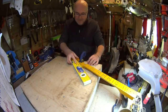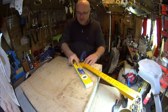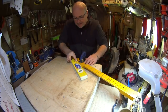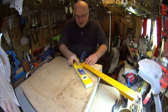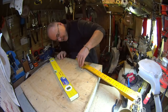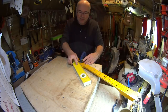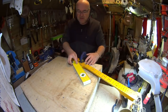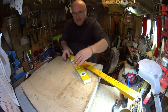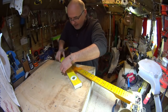Yeah, maybe. As long as it's a good one-handed one, and as long as there's enough room for this to run, preferably a bit in both directions. But you can see it's doing the job, and it's staying pretty smooth, and there's quite a bit of sideways pressure to it. Nice. See, that is beginning to be as good as a factory square edge. So it's a pretty useful technique, but you do need this flat material. Something like ply, thick ply, or several layers of ply. That's very good. Now, if I was being a bit more careful, I'd probably have this also clamped so I can put force into it without it moving anywhere.